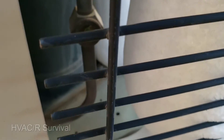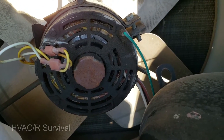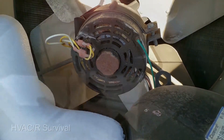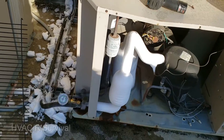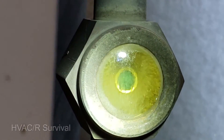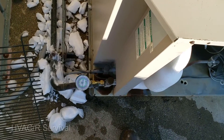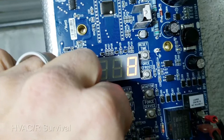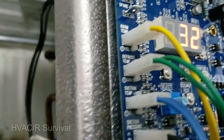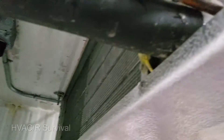This has a headmaster — I forgot to check the sight glass. Taking a peek inside: it does have a headmaster. Bearings are obviously not getting lubricated — that's outside the motor — so you'd usually notate that the bearings are starting to go dry. You can see daylight through the coil. Connecting to the high side to check head pressure. Refrigerant is 404A; superheat set for box temperature. These are electric defrosts — it's a beer cooler, so they're running colder. It looks like we're low on refrigerant, so hopefully we'll find an easy leak.